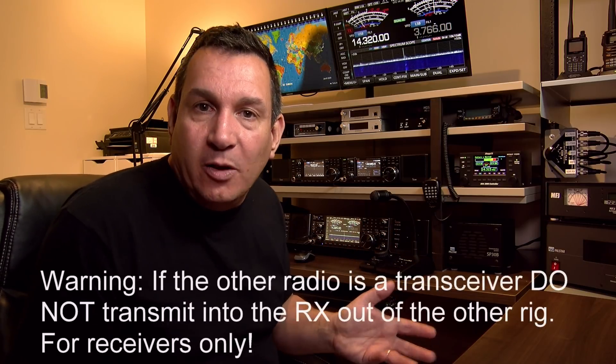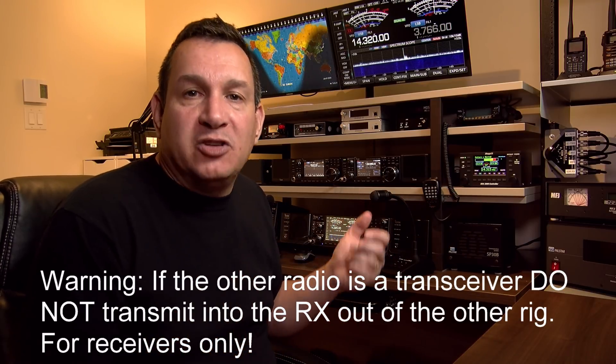But if you want to, you can actually feed a second antenna from an RX out from another radio. That means you use the RX out and feed the other radio, so when you transmit it's put to ground as well. There are also boxes like MFJ makes — the SDR-1708 — that you can use for a second receiver, but not two transceivers. You also have DX Engineering boxes like the RTR2A. I used to have the RTR1A and was able to use two HF radios at the same time, even on the same frequency. When I transmitted, the signal was S9 on the other one on the same frequency. So that worked very well too.